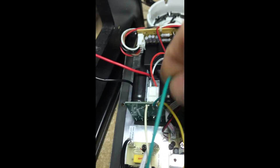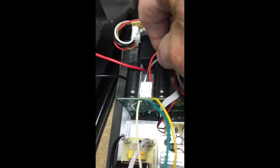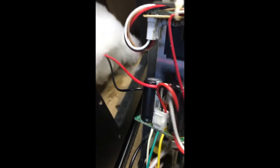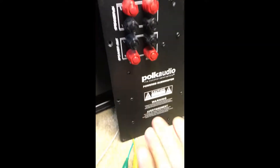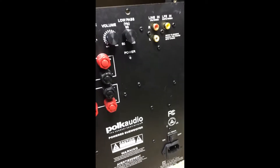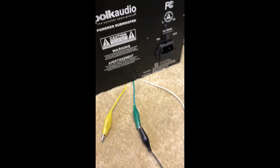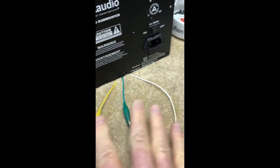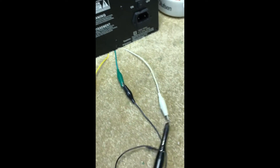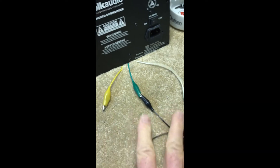To help with that, I've soldered on some clip lead wires to the main supply — the minus and plus 57 volts. We're going to spin this around away from us so it's not pointed at us while we have the lid up. Should there be a problem, it'll go back into the cabinet and not into your face. The plus and minus 57 volt supplies are now accessible via these three clip leads: ground, plus, and minus 57 volts — I can connect a voltmeter or scope here.